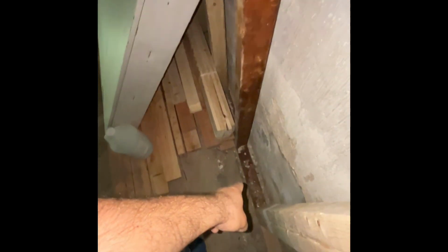Now, the last bit is this here. I have the grounding wire coming up to here. I'm gonna buy an adapter. If you could drill a hole right here to run the grounding rod, which is right here, run the ground rod into the ground, that would be ideal before we close it up. And then just tie this into the grounding rod.